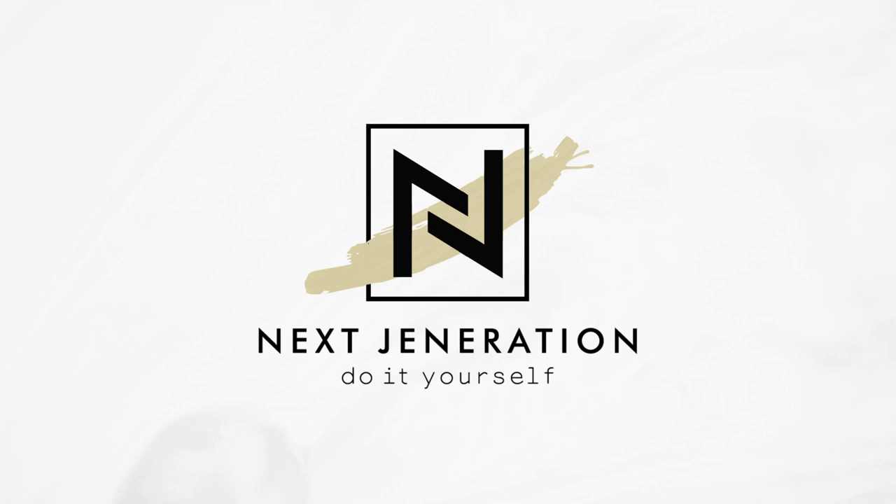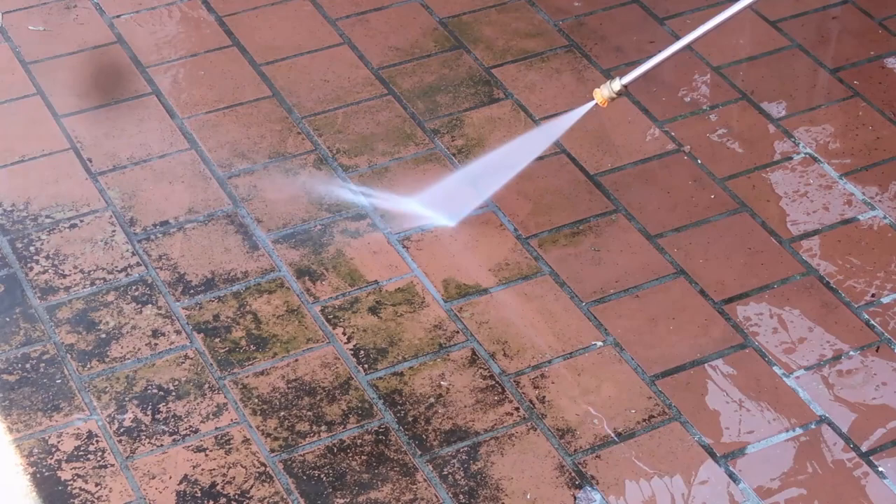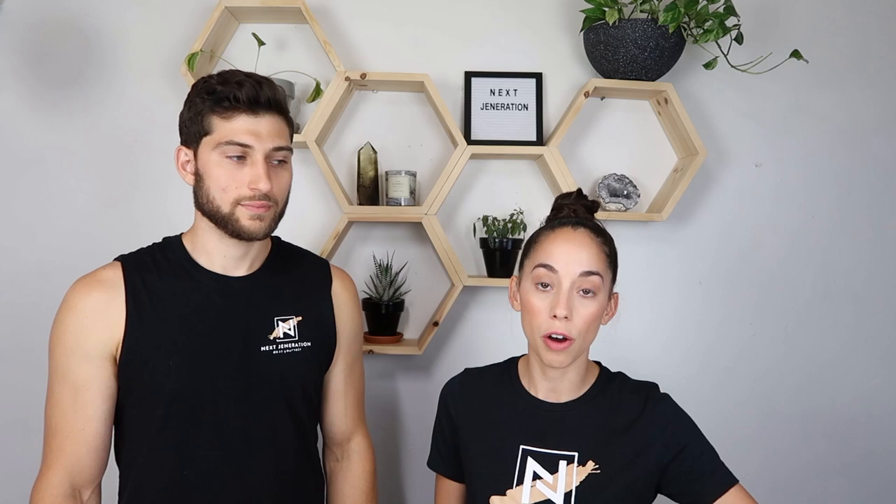Another first in this video — I've never pressure washed anything. I know, it was a shock for me too, because I'm obsessed now and I want to pressure wash everything. We rented a pressure washer from Home Depot; it was only around $25. You first want to start with a little test spot to see which nozzle you want to use. A few of the nozzles didn't work too well — I needed one that was really small so it could really knock off the mildew and algae built up on the ground. Then we did the most satisfying part and pressure washed the whole patio floor.